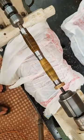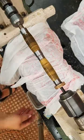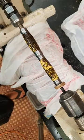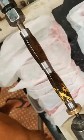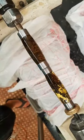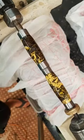Alright, we'll call that done with the wet sanding of this stuff. Let me clean off the blank. Man, that's pretty nice. That is with the Zona paper from 30 micron to 1 micron in maybe 6 sheets, I think. That's a pretty dang nice finish to have not touched it with any buffing compound yet at all. So yeah, I'm on team Zona paper.